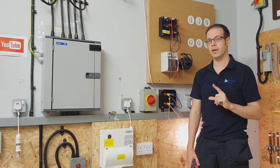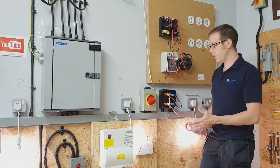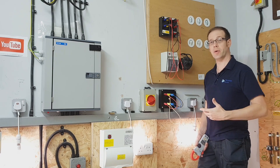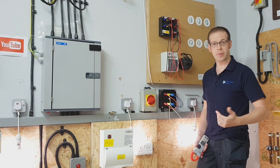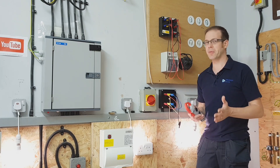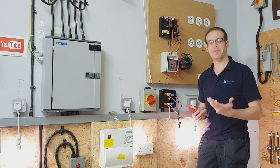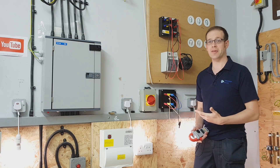So far so simple. At this point though we're going to introduce something that's a little bit different. If I turn all three lamps on so now all three loads are connected — if I unplug any one of L1, L2 or L3 the relevant lamp goes off: L1 goes off, L2 goes off and L3 goes off. Now what do you think is going to happen when I unplug the neutral? Common sense and the build-up we've seen so far would tell you that all three lamps will go off. That would be logical, wouldn't it? Let's see what happens. So the lamps stay on. We're now saying that these three loads are all remaining on even without a neutral connection, and that really is the mystery behind a three-phase load — how can it be that these lamps are all turned on if we don't have a neutral connection? That's the question we're going to be answering in future videos.